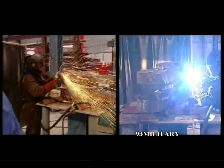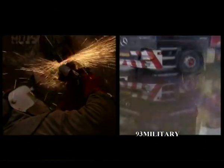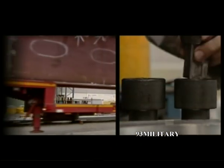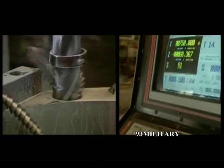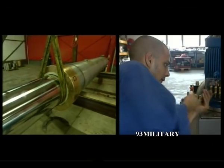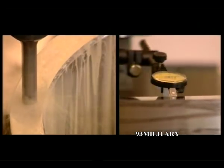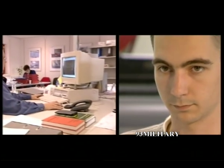The animation made it all look feasible, but the reality was something different. There were only five months to handle the total job from preparation to actual lift. Preparations began in various places around the world. Altogether, 26 lifting units had to be constructed. Each lifting unit consists of a strand jack, a heave compensating system, an enormous cable reel, grippers, and gripper guides. Besides the strand jacks, every part of the lifting unit is specially designed and constructed. Hundreds of technicians work on all parts of the lifting system, and computer programmers are working overtime to get the lifting operation systems ready in time.